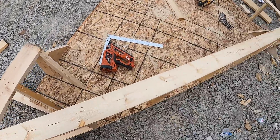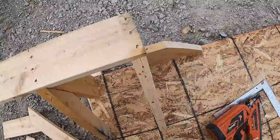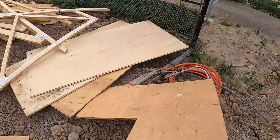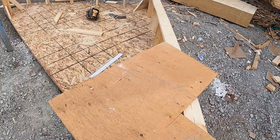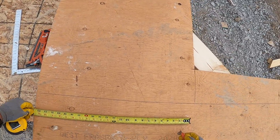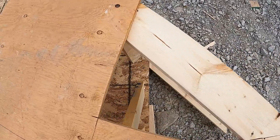Now I'm going to leave it back for brick — leave it back five inches, so looking at seventeen by seventeen, two feet. Another vital skill in framing is learning how to scribe. There's my seventeen — it really speeds things up. If I had to bring out a chalk line here, that would just be a total waste of time.